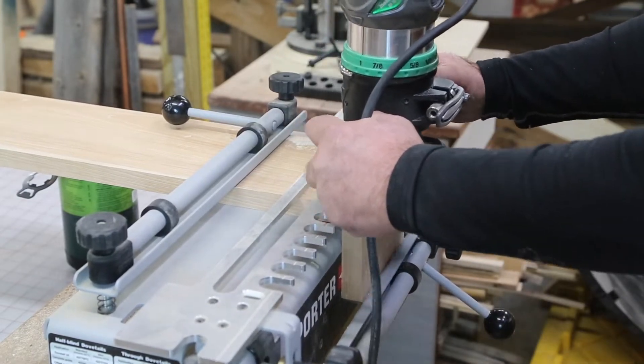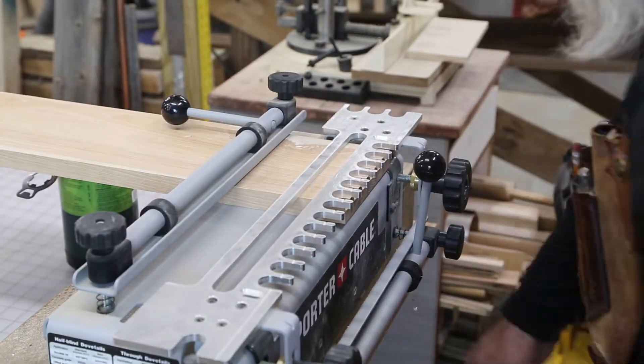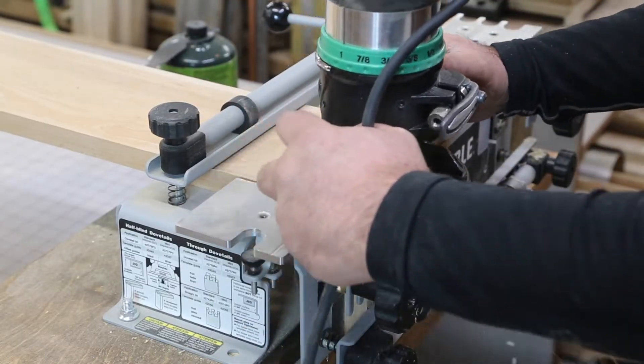It's just another fun way to use the tools you have and gives you an excuse to go use them. If you have a board laying around that you don't know what to do with, this gives you a little shelf — something that'll come in handy to help you organize your work. After we get it cut and jointed and ripped down, just like we've said in previous videos, that final measurement on the rip doesn't really matter. Just make sure you cut enough boards so they're all going to be the same width — that makes your glue-up process go a lot better. Rip them all the same and cut yourself some extra in case you make a mistake.